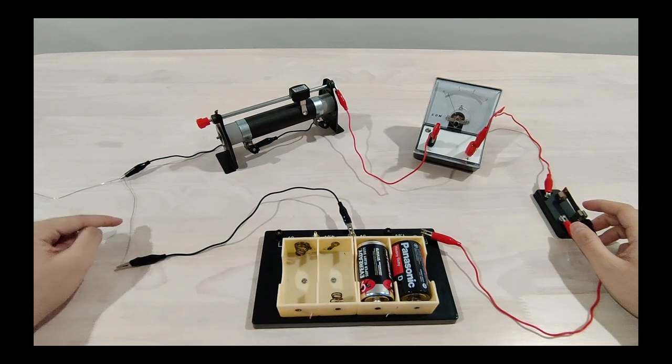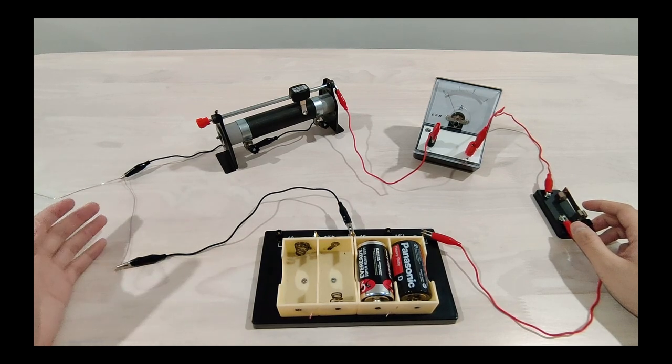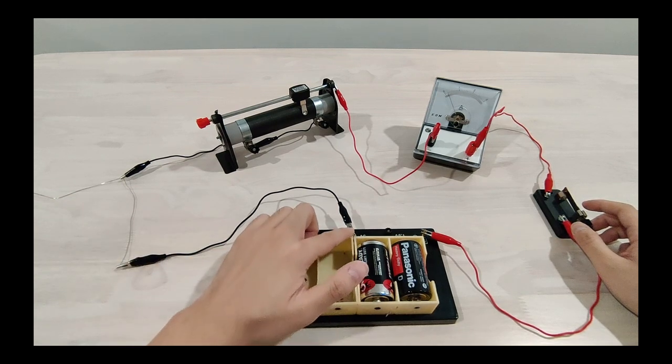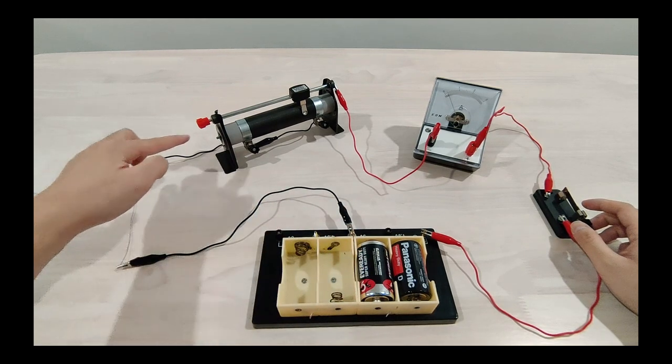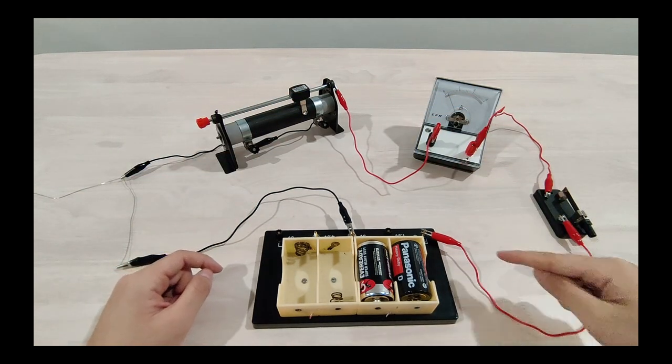It looks like almost everything is done already, but there is no way for me to determine the potential difference across this 10 centimeter wire. So how do we connect the voltmeter? Please bear in mind that the circuit is a series circuit, starting from here, flowing like this, into the rheostat, into the ammeter, across the switch, and back again.